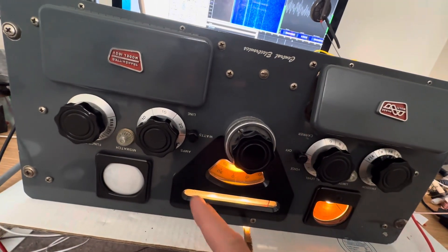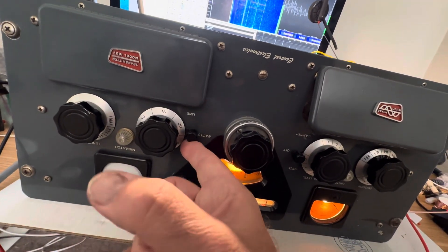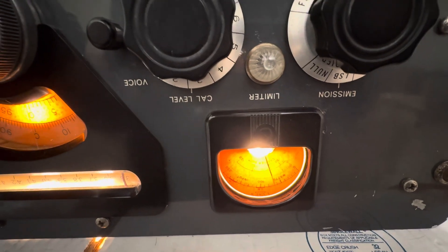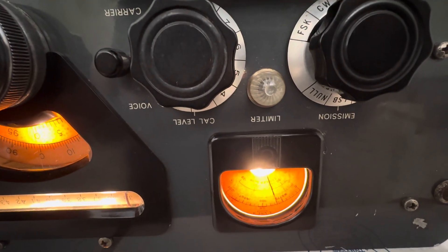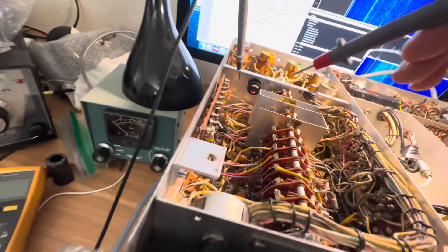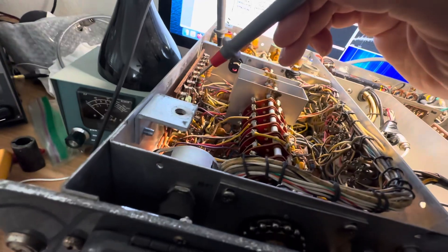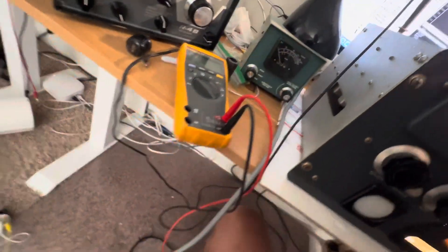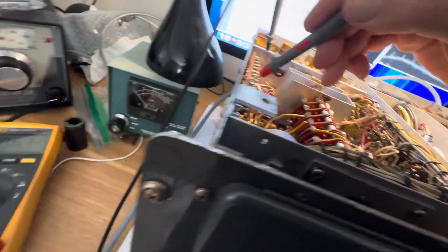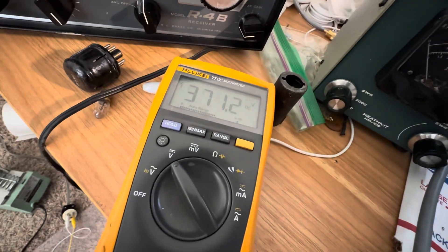To keep it from over-voltage, here's my line reading and it's not up to center like it should be, but I'm putting about 90 volts in. With that I have the filaments all running, and I have decent voltage. If I measure the low B+ here, it comes in around here — the low B+ should be around 340V, but I'm coming in about 370V when running 90 volts into this thing.